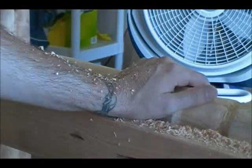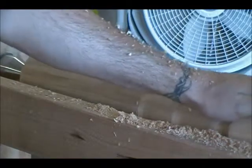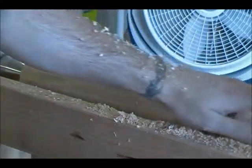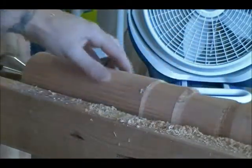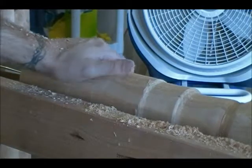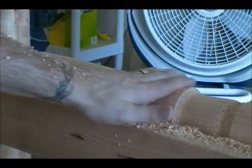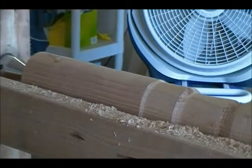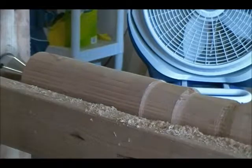I had to do some repairs on this thing over the last couple of weeks, and we worked on it yesterday. With dry wood with separated grain running in different directions, it's smooth, but you do get the rough grain. But if I go over that down here with a skew or, like I said, just an overly wide bench chisel, I get that really nice finish. Part of that's because of the speeds we can get out of this thing. I don't know if you heard it on the video, but you can actually start to hear the flywheel hum because it's going so fast.